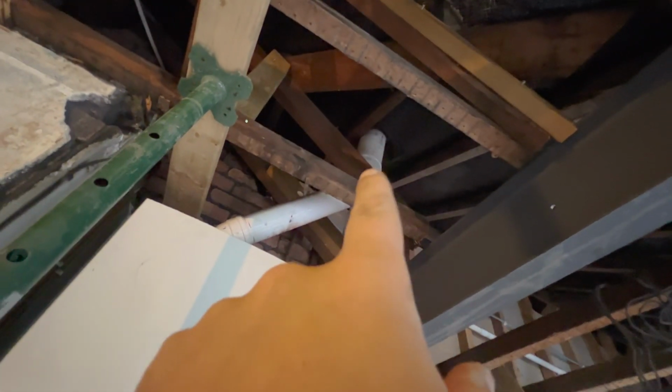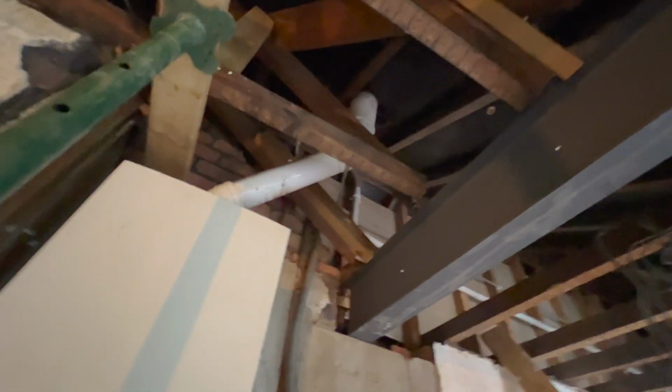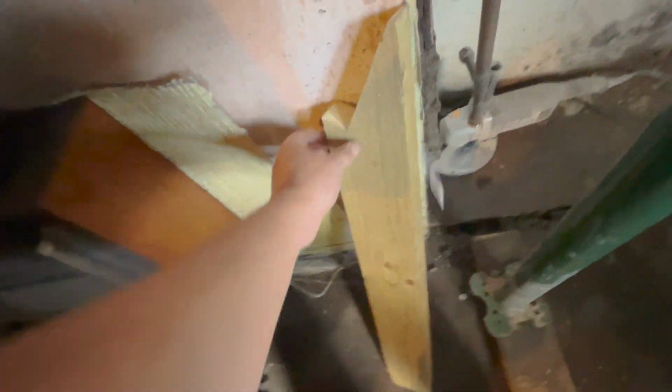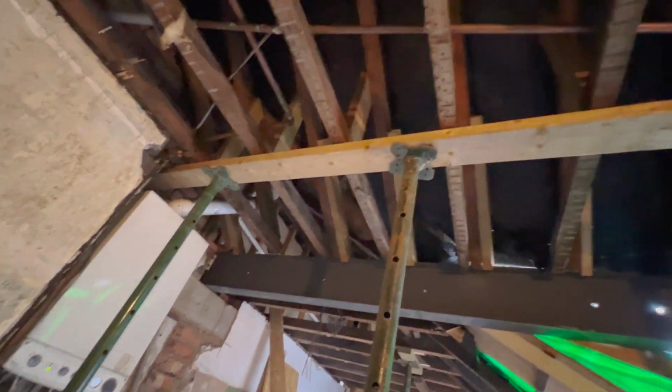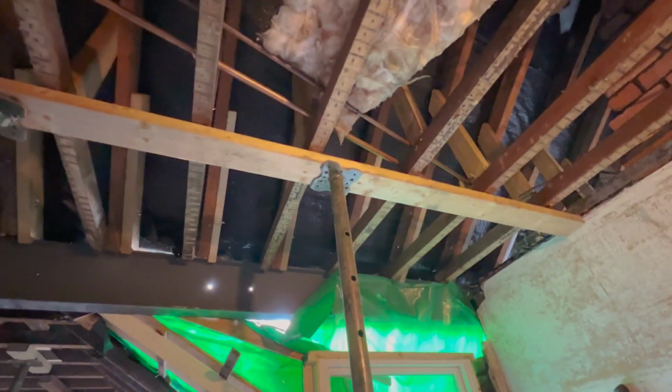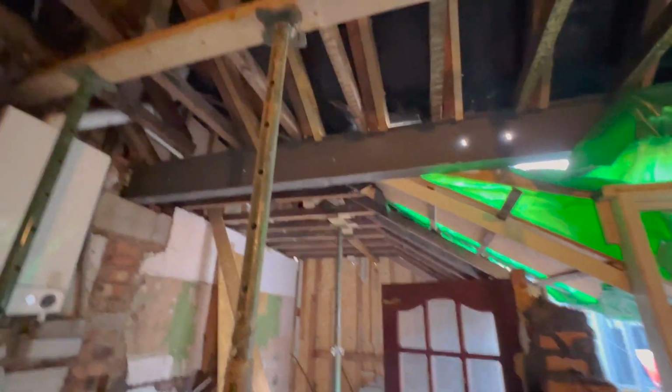By here, can you see the flue? It's on the backside, it's touched against our rafter, so I can't put that one timber in, which is on the floor. As you can see, I've already got my bird's mouth cut. I got them all cut yesterday. So I'm now going to go back to the GoPro and take down the last 3 acro props, remove this timber, and that's this room completely open.